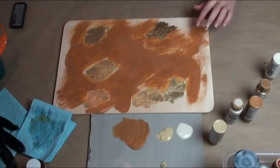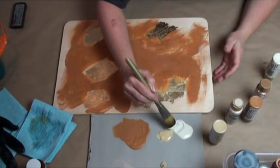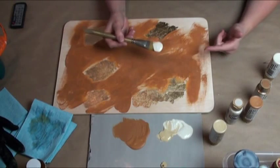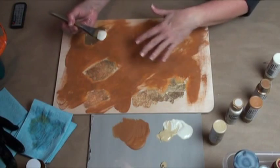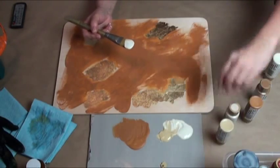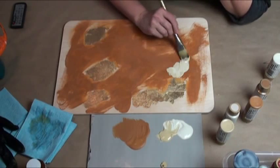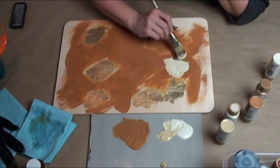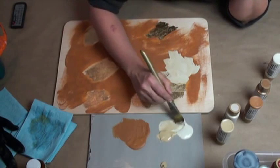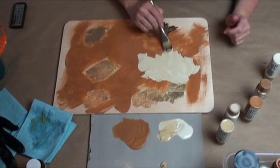I've got a nice messy mess. I'm not quite dry, but if you lay your crackle just a little bit to the side you can kind of get by with it. If I want big cracks, I'm going to add a lot of paint; if I want little cracks, I add a little paint. I want to cover this mess. I've got both desert sand and bleached sand in my brush, picked up real juicy. My brush is way down low, and I'm just going to slip-slap — heavy, thin, heavy, thin. Don't worry about blending those colors — we've got sanding, glazing, and all kinds of stuff to do. You're going to see crackling happening right away.